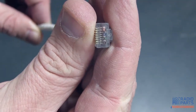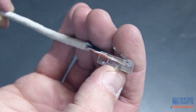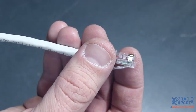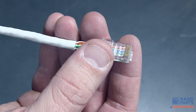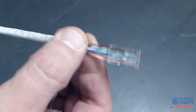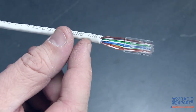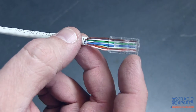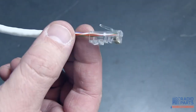You can see the pins all have to butt up at the end there. When I crimp it down, I crimp all those pins — they cut into the cable and hold it in place and make the connection. However, this isn't right. The PVC should be right up inside here for a nice tight grip, and then these should only have a very small amount on the end.